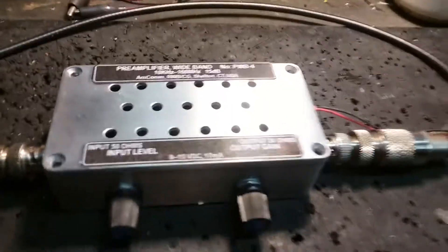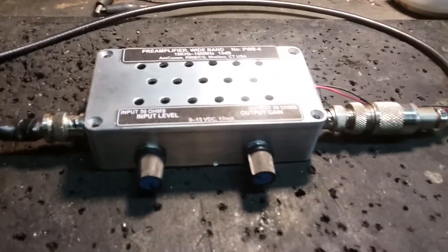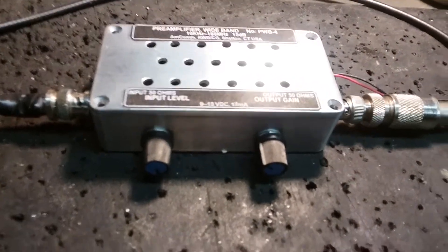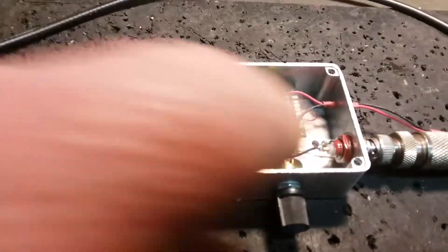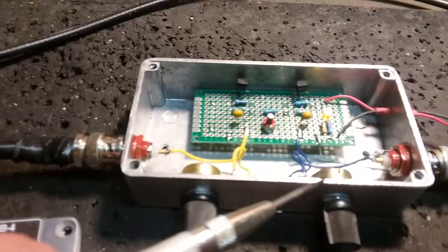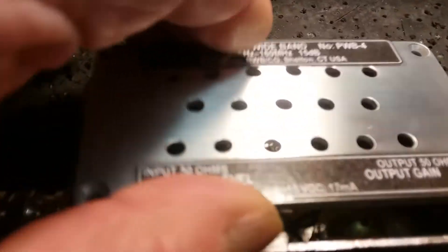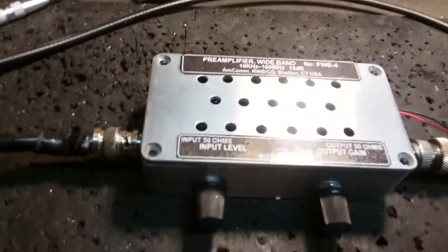Here are the two versions we've been using. This one was made to go inside a unit — it's double-shielded because the preselector unit is in a steel case, but we still put this in its own case too. The outdoor ones have a groove all around the perimeter with a silicone rubber O-ring, and then of course the top goes down — they wouldn't have the vent holes in them.